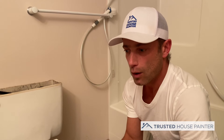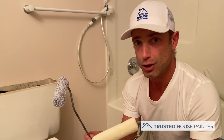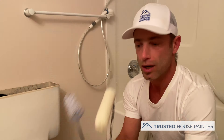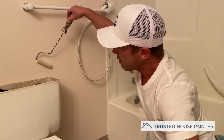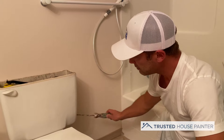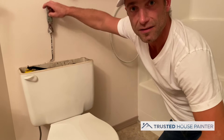After you've cleaned and prepped the walls, there's a tool we use as painters called a whiz roller — what I call a Johnny roller. They come in all different shapes and sizes and are good for all sorts of applications. For toilets, there's not a lot of room behind them, so what I like to use are mohair or velour rollers. They're very thin, they don't hold a lot of paint but they do the job, and you can actually get in behind the toilet and roll from all sides.